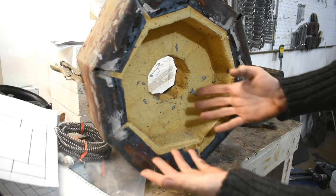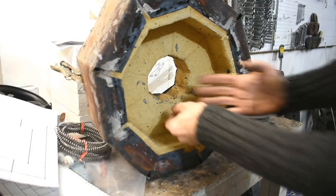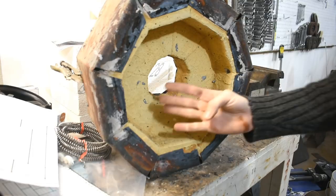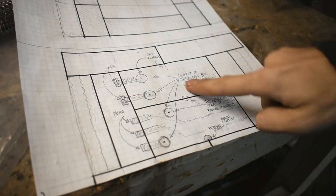Anyway, that's what happens when I've melted cast iron with this thing, so steel is not going to like it too much. But it works is my point. Concept proven. So, got the structure figured out, got the insulation, got the enclosure figured out. We're going to wire it up with these kiln elements that I got. What's left? Control.